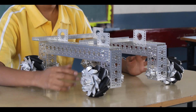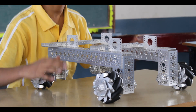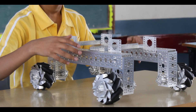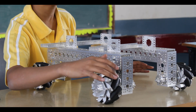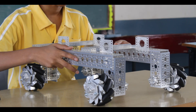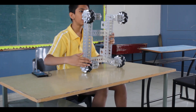Next up we have these Mecanum wheels from Nexus Robotics, currently available on Robotshop — I will put the link in the description below. One of the most advanced and useful drive trains used by many FTC teams is the Mecanum multi-directional drive train. These wheels have rollers positioned at 45 degrees, allowing the robot to move not only forward and backward but also sideways. The setup uses four wheels where two point inwards and two point outwards.